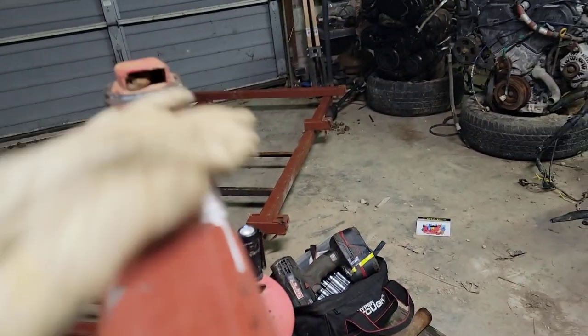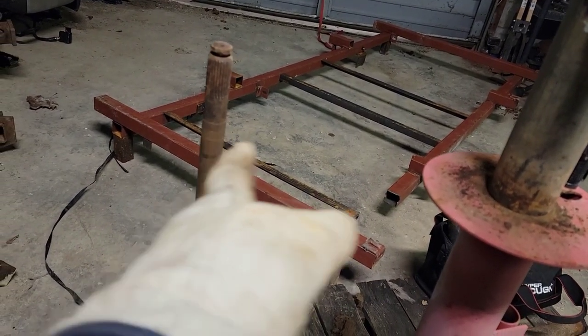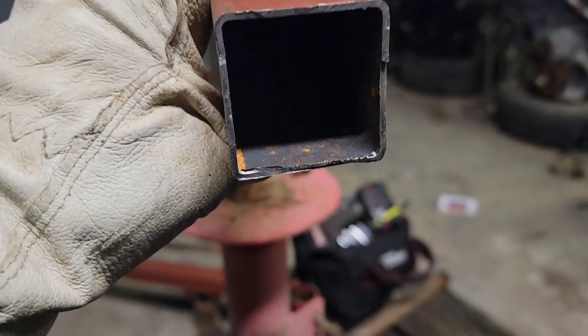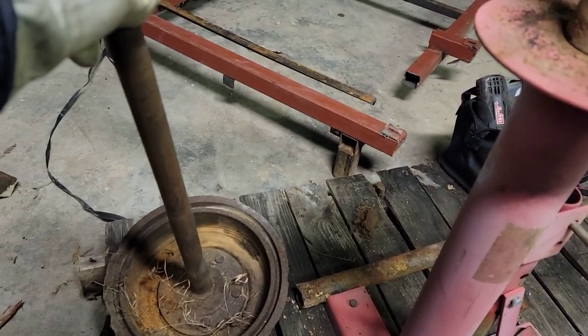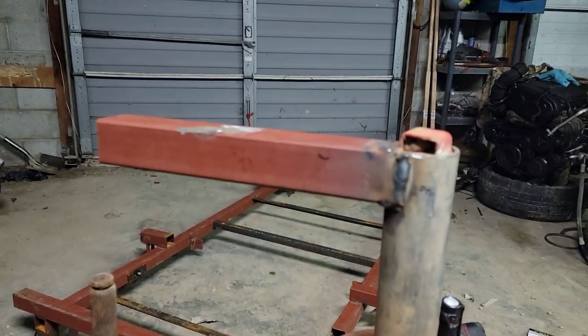We've got to get this slider right here to slide. This had something welded on it — I still got to grind that off just a little bit. This stuff may be too thin, but we're going to use that. And of course we're going to use an axle. I know this pipe's not too thin. The tubing's kind of thin, but it's almost quarter inch — about 14 gauge is what my gauge tells me. But I know this is overkill. I'll come back and show you what I've got it looking like.